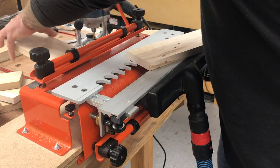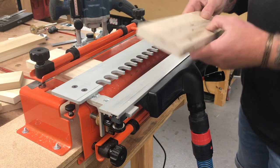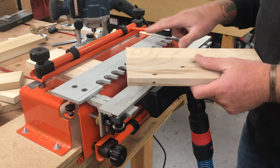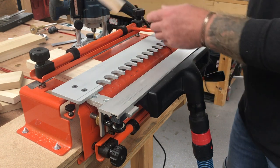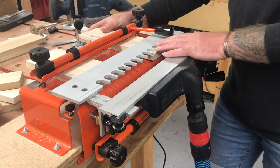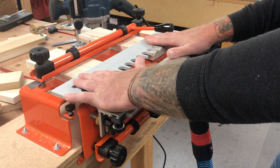That's going to go in there. So the clamp comes under, slides under. But I want to put a piece in this side as well. I'm not going to cut that. I'm not going to machine that. That's really just to support the template, to support the plate that you're running on. All right? So everything stays flat and level.